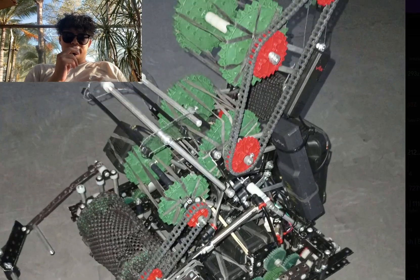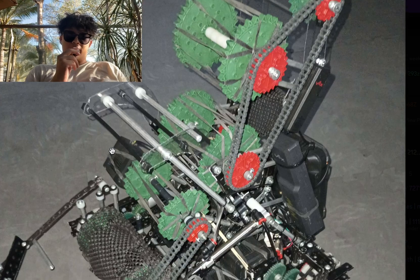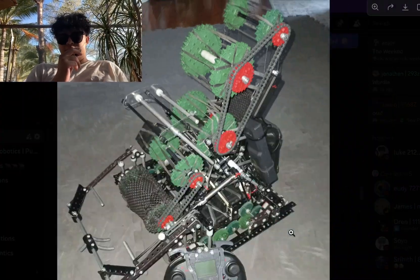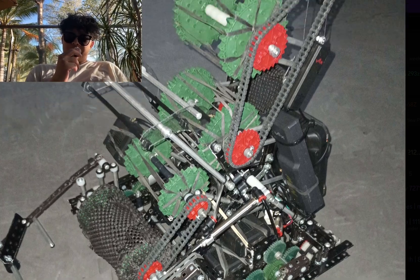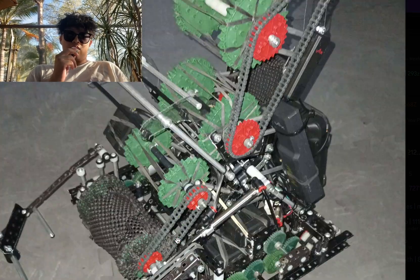Let's take a look further in detail. What's this piece here? I'm not entirely sure, to be honest. Is this for scoring on a middle goal, like it comes out here? That's weird. I don't know if I like that a lot, but if it works, it works. Battery placement — it's alright, it's okay. I feel like I would get a little scared of that battery placement, but if it's fine, it's fine. I don't really like this — if this chain skips at all, your intake won't work. I would suggest extending this out a little bit and then connecting this bracket to here, and then connect this piece to here — two different bracket connections rather than just one that goes across the whole thing. That's the one thing I don't really like on this.